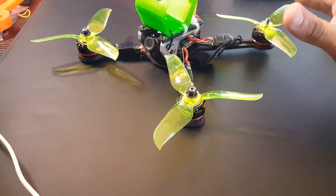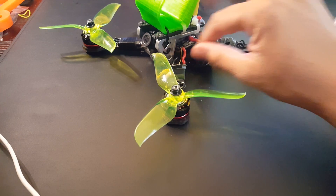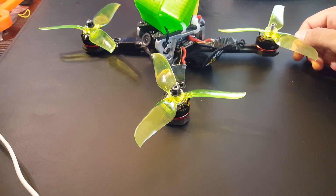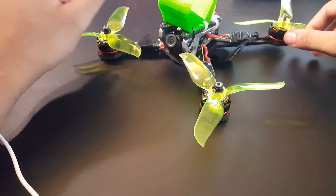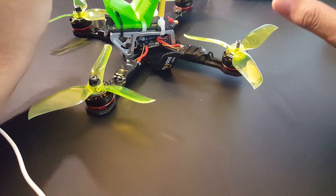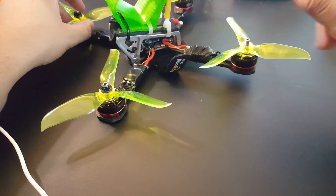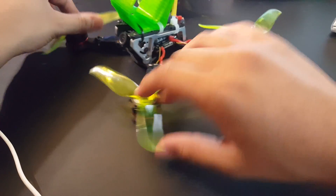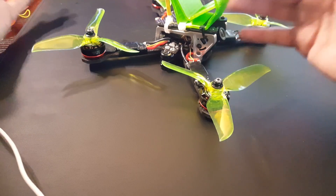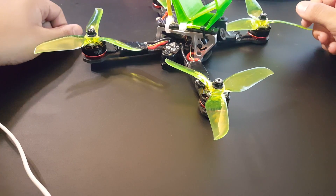This board seems very reliable. Usually I have to deal with a bunch of headaches just to get a board flying — tightening or loosening dampeners, something coming loose. Not with this one. This frame, this setup, this board is just absolutely perfect. I think this is my favorite quad, but not yet — until I fix these motors. Once I replace them with something else and find something nice, then we can reassess. But the board itself? That's it. Perfect. They give you everything; all your problems are solved within four minutes. Solder the ESR capacitor, make two changes in Betaflight, go fly and have fun.